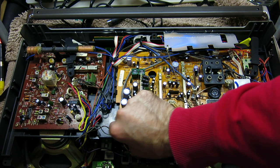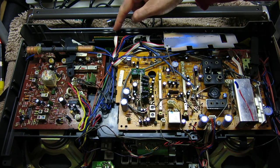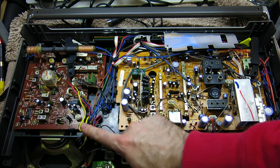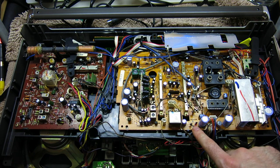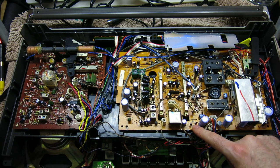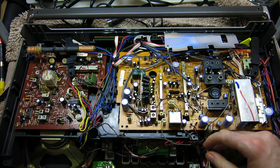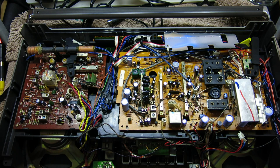The whole sub-chassis is loose, again just the same as the 8290. If we pull that out this way we should be able to get access to the switchboard on top. I've just seen a couple of cable retainers in similar places. This is kind of equally messy as the last one was in the 8290 — maybe that is just the way they do it. The motor wires are soldered on again, and I don't see evidence of them being cut and re-soldered the way they were on the last one. The headphone board wire is soldered in again. The wire for the speakers is on a plug, so we need to disconnect that one.